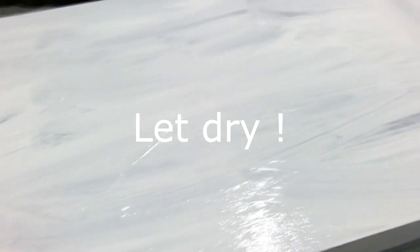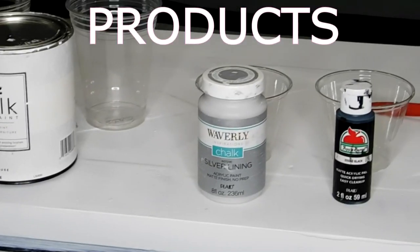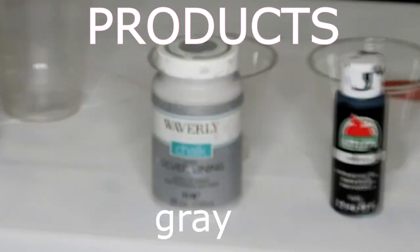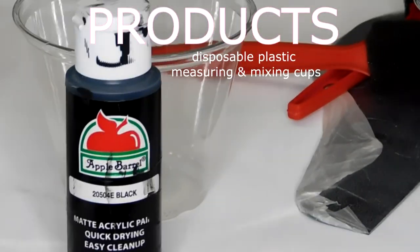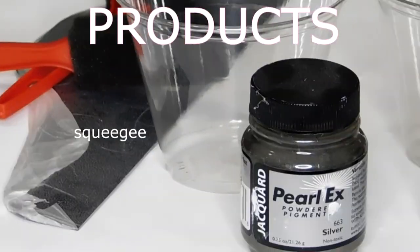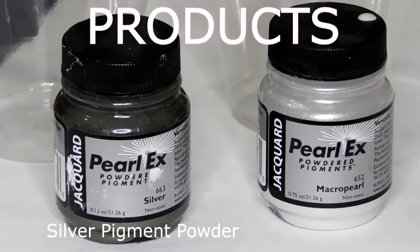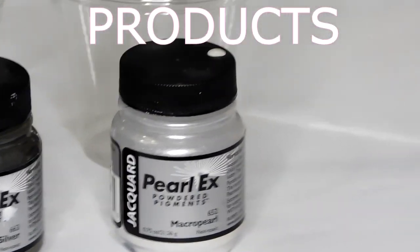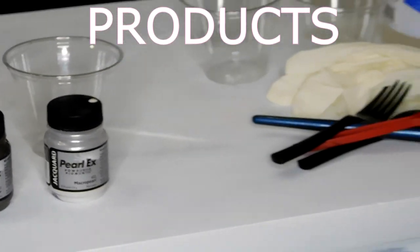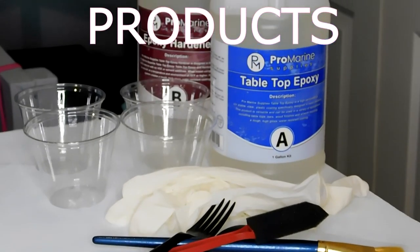Once everything is dry, you're going to go ahead and get all of your supplies ready. You're going to want to definitely tape off around the edges if there's something below it that you don't want to get epoxy on, and if there's something around you want to protect, put plastic down on there too. So I'm using the silver lining, just black acrylic, some white paint. I'm using this pearl silver pigment, this macro pearl, which is like a pearly white pigment, kind of like a seashell pearl, if that makes sense.